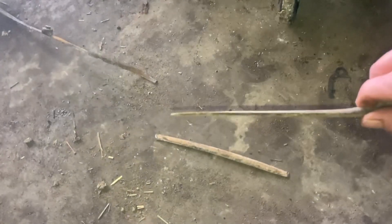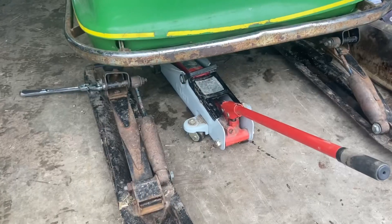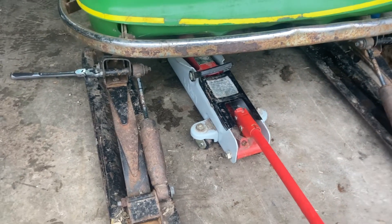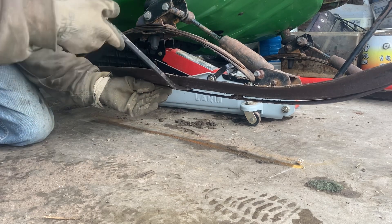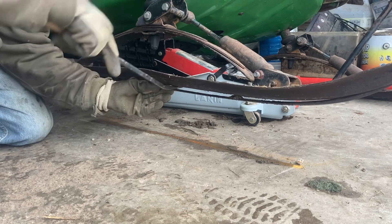You should be replacing the wear bars when the bar itself is about half worn — and this one, well, this is the worst part of it. Next thing we're going to do is get our jack under there and lift her up. Now that it's off the ground, I like to take my pry bar and just pop it under here. This one only has two studs so it's pretty easy — just gently work it down.